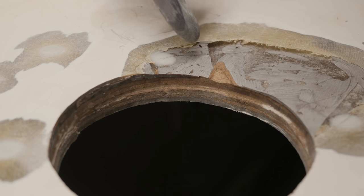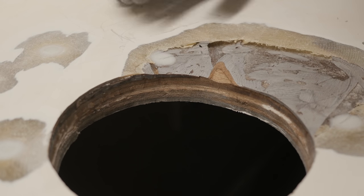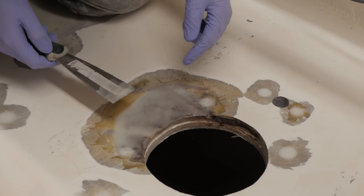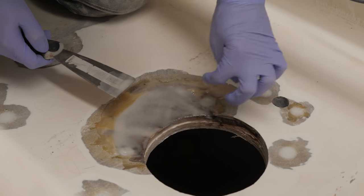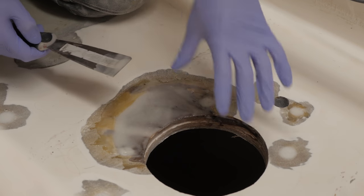Just as with the voids I found last winter, these appear to be pretty deep. The correct fix here, of course, would be to keep grinding until you reach the end, but then I might as well replace the entire top skin in the sandwich construction, and I just don't have time to do that. I've injected thickened epoxy as deep into the voids as I could get it, and I've used a little bit of thickened epoxy here to take up some of the unevenness. I am going to lay up new laminate in this area here because that's going to be taking the load from the pedestal.